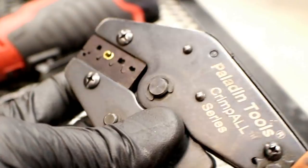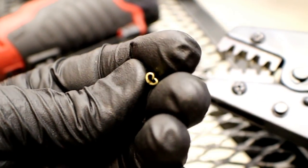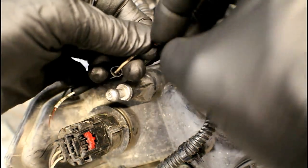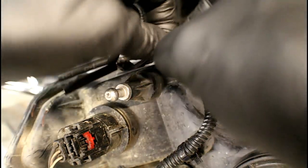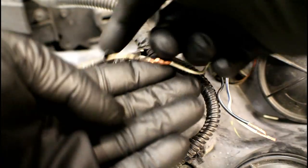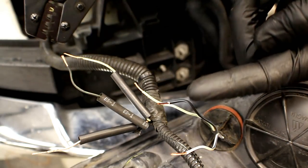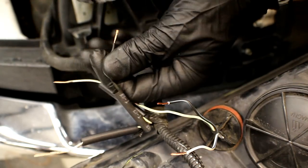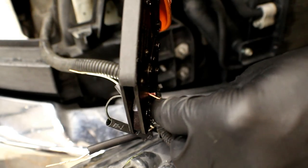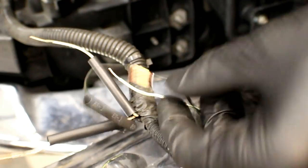Once you've got them in place, squeeze down on it and it actually crimps that brass into a nice tight fit. If you don't have the crimping tool, you can just grab the two wires, twist them tight — that's just a temporary hold until we apply solder, and once we apply solder that'll be the permanent hold. Then slide the heat shrink over it. But I've got the tool so I'm going to be using it throughout this video. I'll go ahead and grab that crimping tool, find the corresponding matching wires, crimp them nice and tight, and repeat it on the other two wires as well.